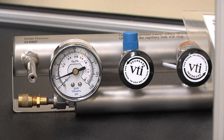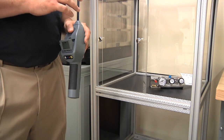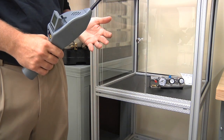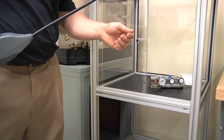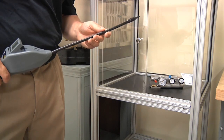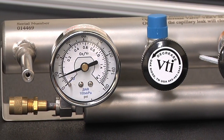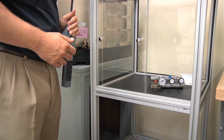What we have here in one of our JB laboratories is a calibrated leak, or a standard leak. It's very expensive, and this one is set to 0.05 ounces per year. A lot of people open a can of gas with all different methods for testing their leak detector, but using a standard calibrated leak is the best, although they're not generally available. That's why we include our test vial in the case. We do have standard calibrated leaks here to meet the strict standards we designed to.